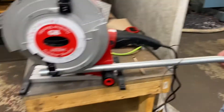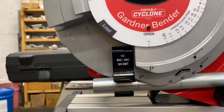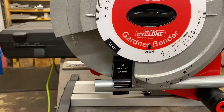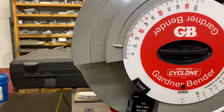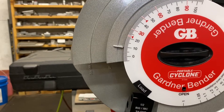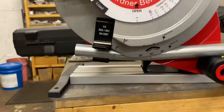All right, we got our piece bent there. Now we just got to do a little offset for the box. Could always use an adapter, but I just like doing offsets. So let's do a 10 degree from here to here — 10 degrees. I'm gonna go a hair, just a millimeter. There we go. Because there's a little spring back happening. So there's our first.